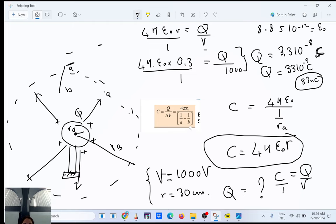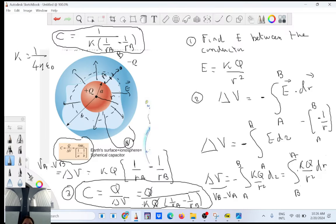And so you see the voltage, in the demonstration I did here, you're going to have 1 over R. Because when you go from electric field to voltage, you take the integral. When you go from the opposite, so if you go from voltage to electric field, you're going to take the derivative. Very good. Okay.